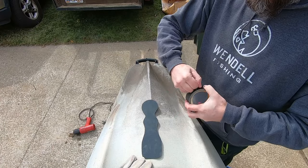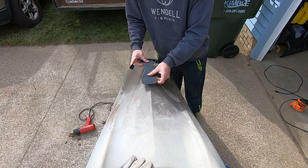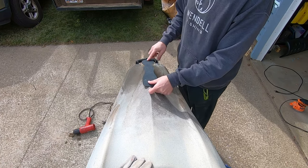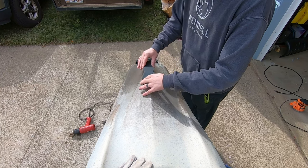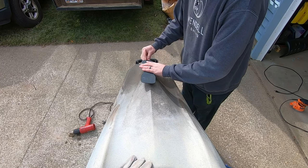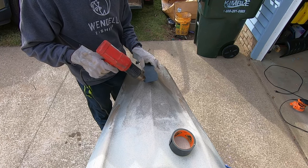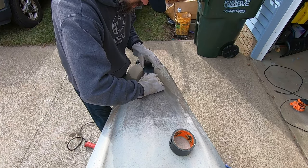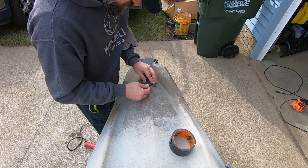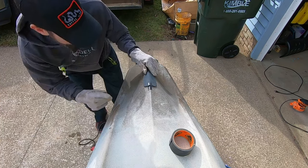To hold the kydex in place while you mold it, tear up a little piece of tape, decide where you want it, and tape it down so your hands are free. Once you apply heat the tape will let it slide, so work on the back first, mold it over, let it cool, then move the tape and mold the front. You'll know when it's ready because it gets kind of floppy. Heat it up and get it molded over.